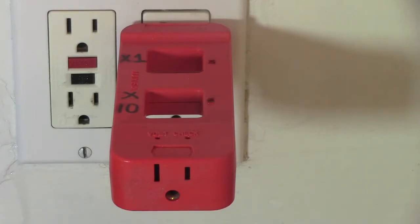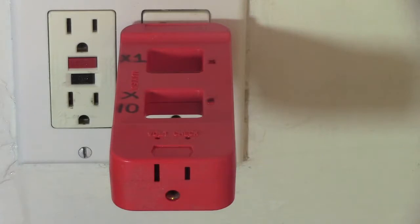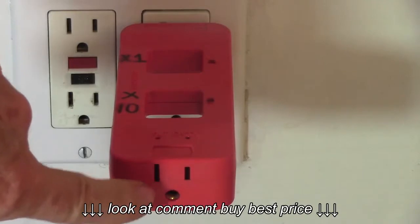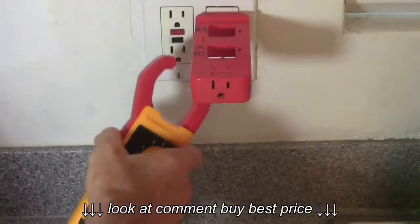For instance, in a kitchen, frequently as an electrician I'm called out to a house because their circuit breaker keeps blowing for a kitchen circuit. I may elect to use this AC line splitter — you take and plug the different appliances and devices into the back of it, then you take your clamp meter.